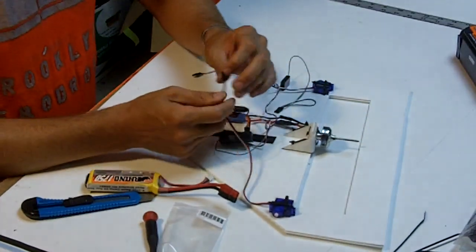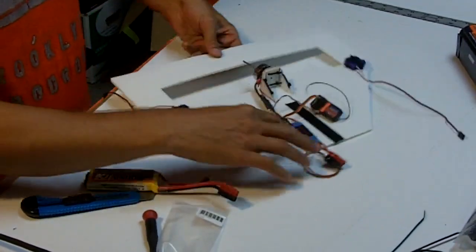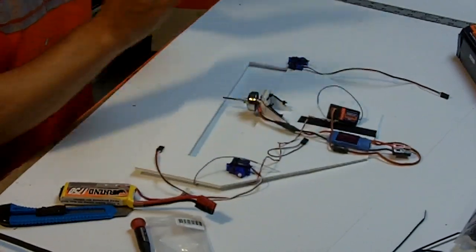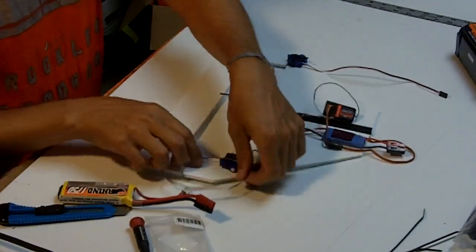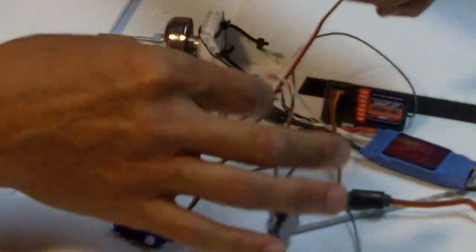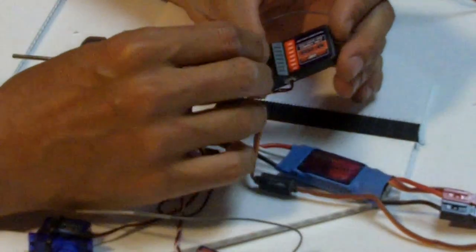We're going to take this servo. Your right servo will go in, this is from the pilot's direction, so when we say right and left on this airplane, it's the pilot's view, so we're flying this direction. So the rightmost servo will go into channel 1. Everyone needs to adhere to this convention for the programming in your radio to work properly. So that will go into channel 1.